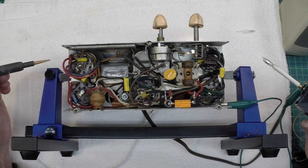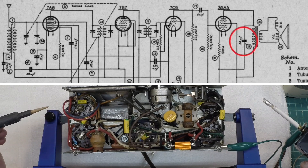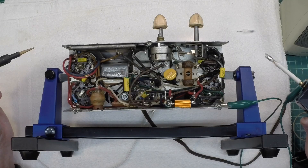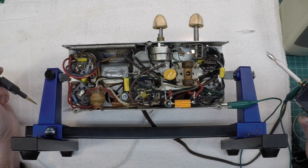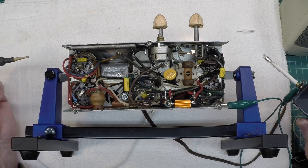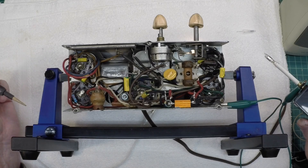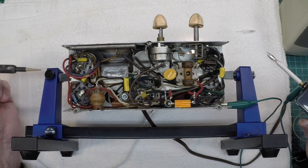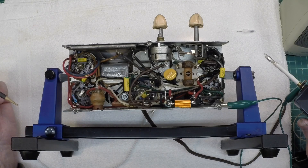I'm going to go back and make a few modifications. The schematic called for a 0.04 microfarad cap on the output tube — I went with a 0.02, so I'm allowing more high frequencies through. Since my loudspeaker doesn't have a surround, I'm already passing a lot of high-frequency information, so I'm going to increase that to at least 0.04 microfarads to attenuate some of the higher frequencies. This will not be a daily player — it was more just a challenge to rewire and see if I could get it playing again, which I've done. I appreciate you guys watching the series. Take care and stay well.